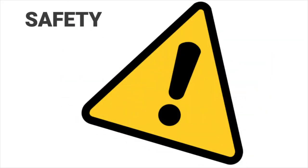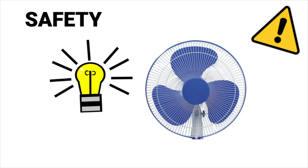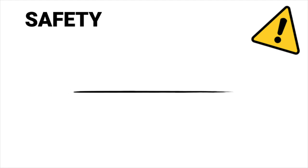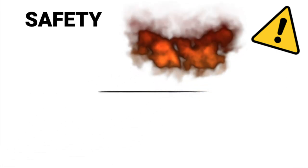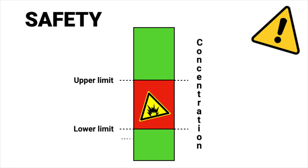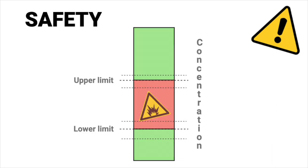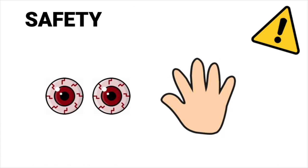Safety is a crucial part when building a paint booth. Any electrical device can cause a spark and needs to be considered. To make a long story short, gases and solvents need to be in a certain concentration to be flammable. If the concentration is too low they won't explode or burn, and the same thing if they are too high. Different solvents and gases have different limits, but it's usually quite a high level needed to reach the lower limit. At that point the concentration is usually visible in the air and it will affect your eyes and even your skin.